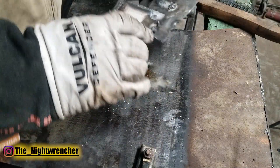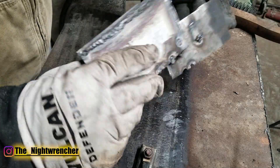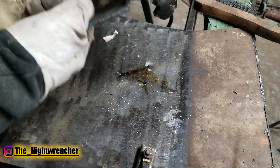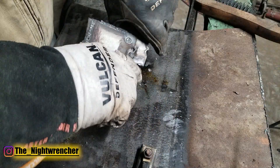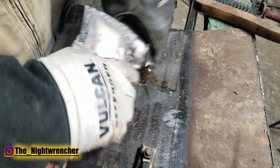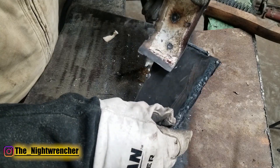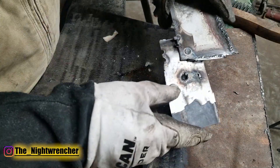It was quick and easy. You start on the bottom — as you guys can see, I have penetration right there all the way through. I just went ahead and turned and spun it around until I got it to weld. If I try to break this just like the other ones, I'm going to have very little luck. This is actually one of the stronger welds because you have so much overlapping material — it's very difficult to break. This is why it's so popular in auto body work. The weld is also really, really flat profile-wise, which you can barely see, and that's a huge reason why it's so popular and versatile.